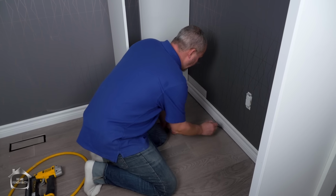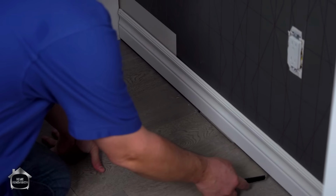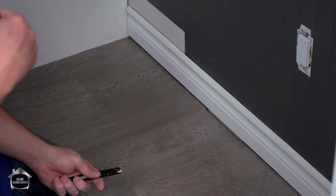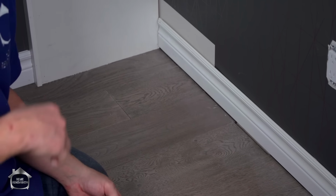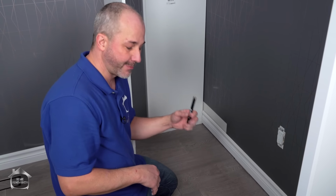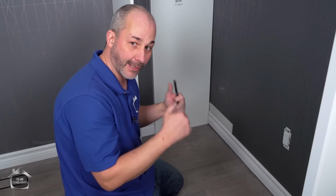Beautiful. Now in this situation here, you'll see that the flooring comes pretty short of the baseboard. So what I did is I'm actually going to be adding a piece of shoe mold, okay? And so then I can dress that up and close those gaps. If you're in a house and your baseboard is too thin to cover, don't be surprised. In most construction, the baseboards are thin and they take quarter round or shoe mold to add additional depth to cover all the edges of the flooring.